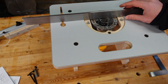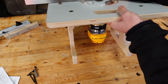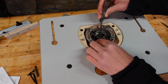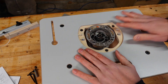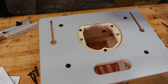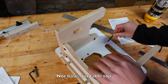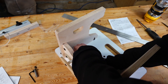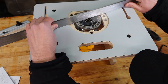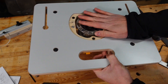We've got a couple of tools. That's super close right out of the box. I can see a little bit over on one side, so I'm going to lower that one. They did a really good job leveling this out of the factory — I think it's probably just one screw I need to modify. Going back to the tools that came with the base, just a tiny turn — and that is perfect. I don't think I've ever had a router table, out of the three or four that I've owned, even come remotely close to that straight out of the box.